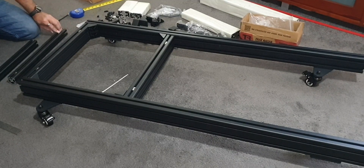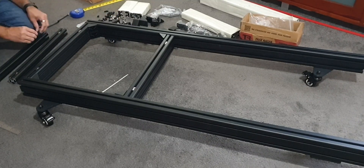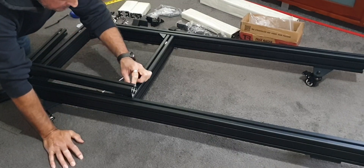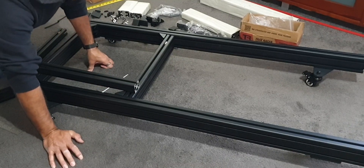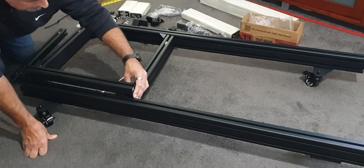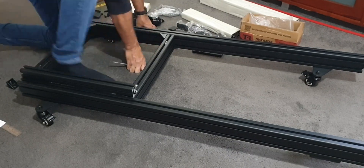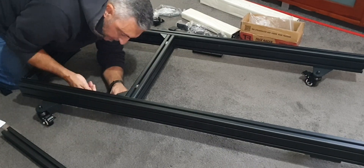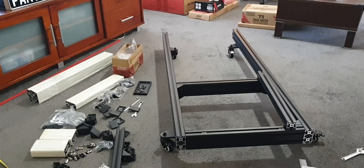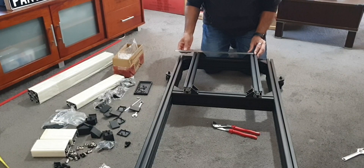Here I'm just doing the final touches on the corner brackets. I've got the 40 by 40 aluminium profiles which are going to make up the base of the seating frame — that's where the brackets or the sliders will sit on the rig. For those who don't know, the aluminium profile here is called 80 by 40 — so it's 40mm wide by 80mm high. Those square ones are 40mm by 40mm. Just lining these up and making sure they're going to be correct. Final adjustments making sure the length from one end to the other is the same.